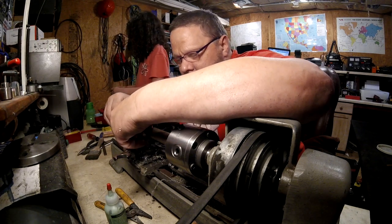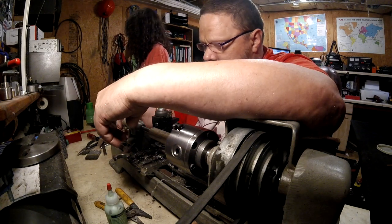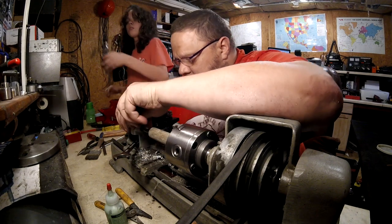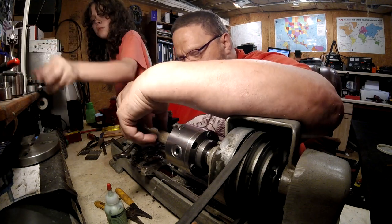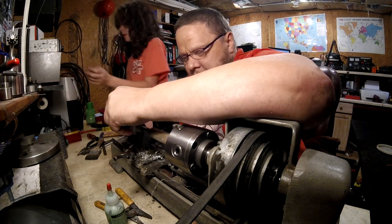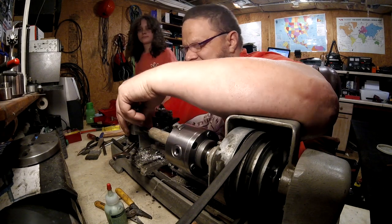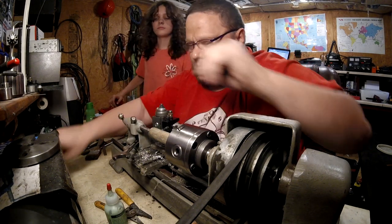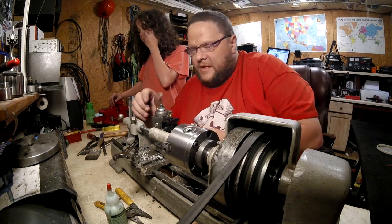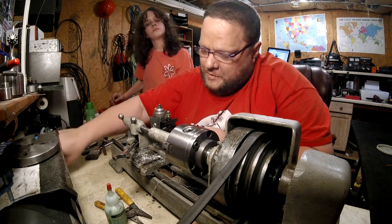Nope. But wait a minute, hold on. We can run it out there to stabilize it. Now we're off of the lock, okay? We're off the lock. But I got the quill lock locked. So hopefully it won't, well, all right. There we go. All right, so what I want to do is just taper this. You've seen me taper it before.